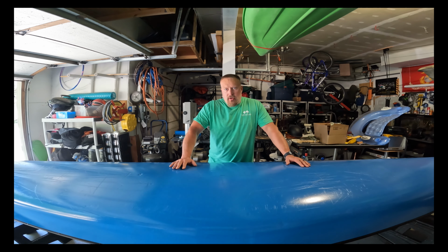used my Milwaukee power buffer as well as some of the Meguiar's light abrasive polish and cleaner to buff out a lot of the dirt soilage, as well as using denatured alcohol to basically scrub away the rouge that gets created by the polish. I actually found that the alcohol does a pretty good job of scrubbing away some of the dirt as well.